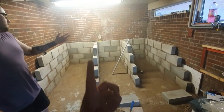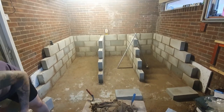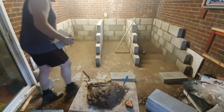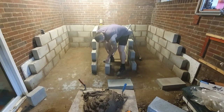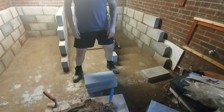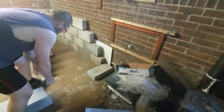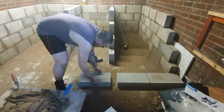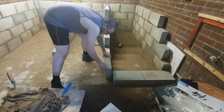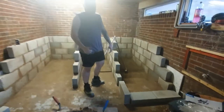The pods have been laid brick on edge — meaning standing up — and that gives each breeding pod an extra three inches. On the front, we're going to lay the blocks flat as Jack is a little concerned about strength. Laying a block flat gives about 220 millimetres of surface area. We're going to tie the pods into the corner of the wall with a bead of mortar underneath to create extra strength and rigidity, running a division and tying it into the front rather than just block against block.